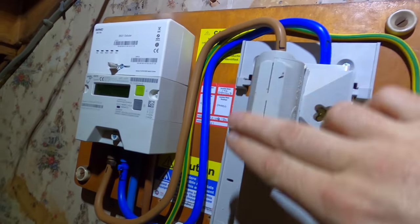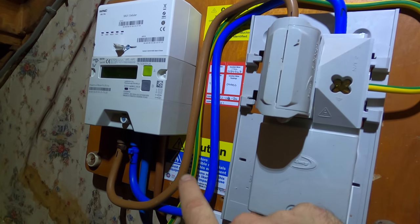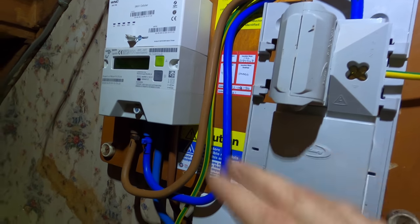The ones coming out of your main cutout fuse - they're not his responsibility - but as a competent electrician you would have thought he'd do what I did: ring Western Power. They came out within the hour and changed them over. Also the test results he had on the house were apparently perfect. This house is an older house, homeowners never messed with anything, so I was a bit dubious on whether that was true. From experience there's never normally perfect circuits when it's not been rewired - it's an older house.